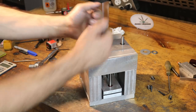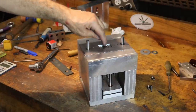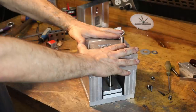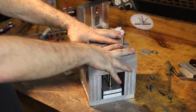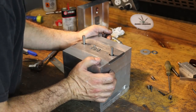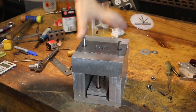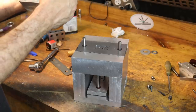The other thing to keep in mind is when the molding machine really crunches down on this with 20 tons, or 25 tons of force, I'll probably get those 2 or 3 thousandths back from just the compression of all of this and all the not quite right seatings to actually press down and press in. These pins are kind of floating, so they'll actually rise up as the rest of the mold sinks down and seats into its final compressed state. So I think it's probably best just to run it as is, because right now the pins are slightly below the surface, which means they're not going to crash into anything when the mold closes. So the final, I guess, cherry on top would be to load this guy.